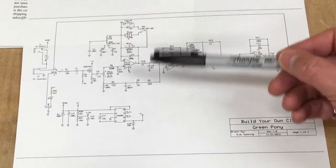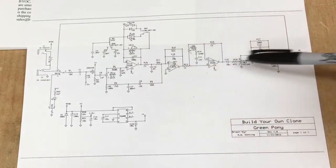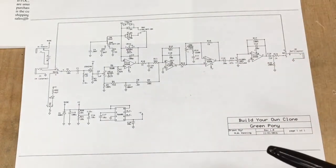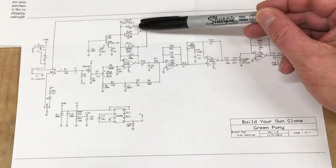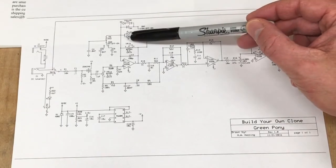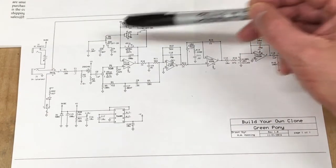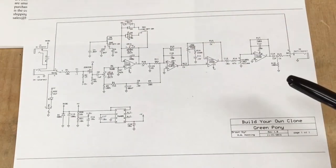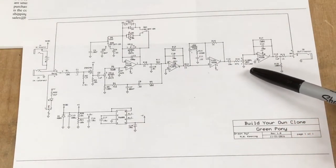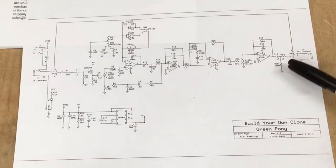So what's cool about this is that the more you turn up the distortion, the more signal of distorted character goes through the rest of the signal path. And what's cool up here is you have different flavors of clipping: diode clipping, these are LED clipping, asymmetrical diode clipping, or none if you set this switch in the middle. You've got a little tone control circuit there too, so that's pretty cool. The tone circuit is a little active circuit, which is neat, and at the end you have a volume control which feeds its own operational amplifier, and the output impedance is very low. It's only 1K, which I think is cool.